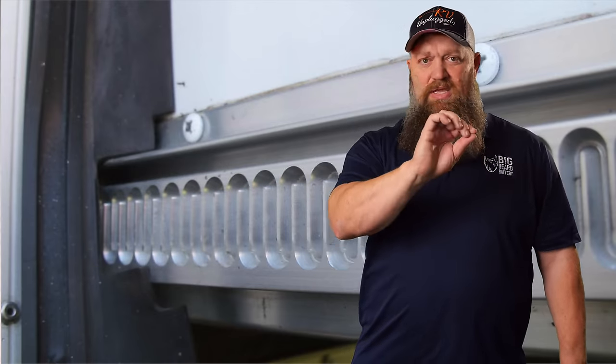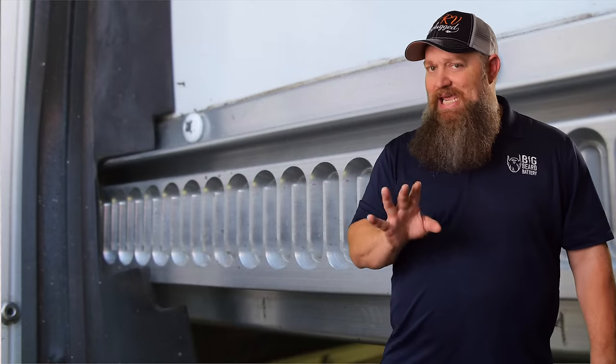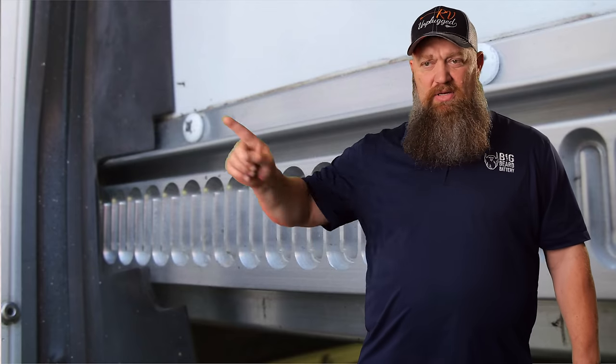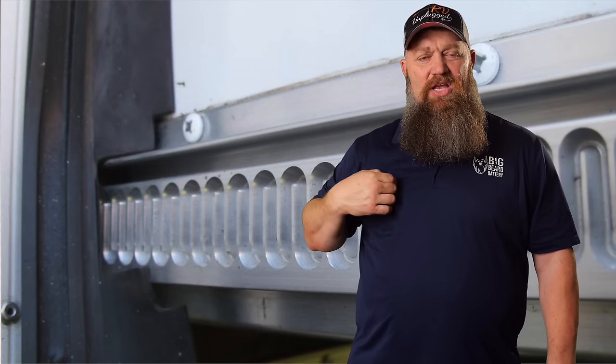The reason why I have you use a dry lube is it works. You do a two-step process: use a penetrating lube and a toothbrush to clean out those tracks, then come back with a dry lube to pull out all that oil. That schmutz will eventually end up on that motor sprocket. So when I say clean it out, I mean clean it out.